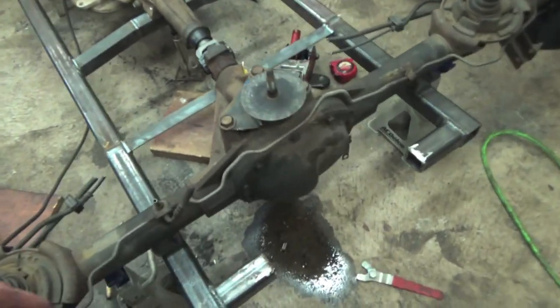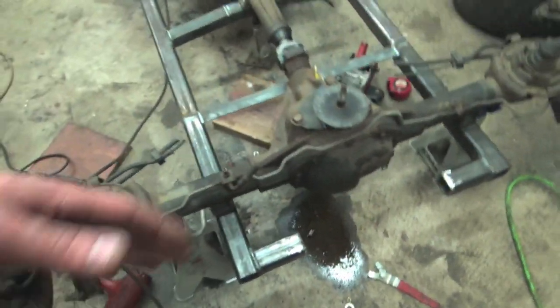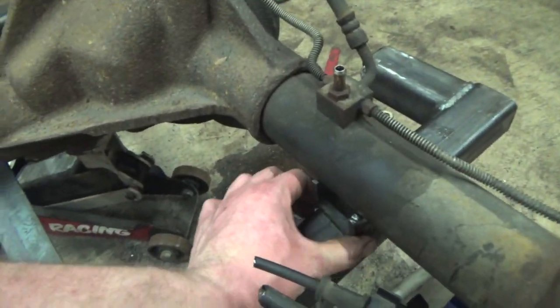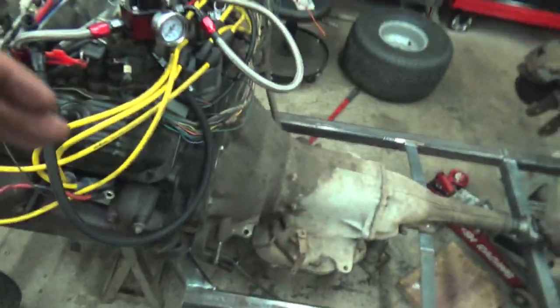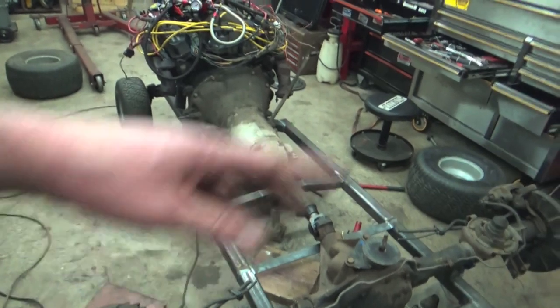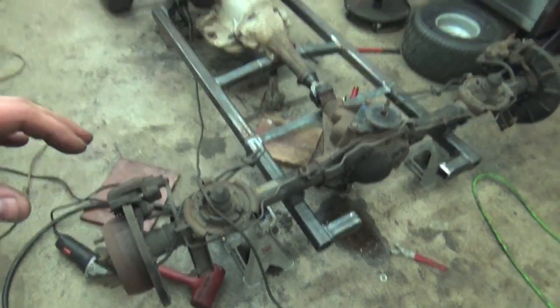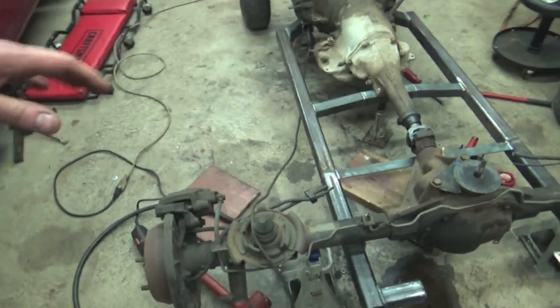We've been welding, chopping, and cutting metal getting this frame finalized and welded up together — not totally finalized because we still have to pull it apart and finish welding underneath it, but it's pretty much almost all the way done. I did run out of metal — I wanted to attach a trailer hitch right here so we can move trailers around with this thing. We do have a couple of cross braces added in, the extension pieces put on, and the leaf spring shackles in place. This thing's ready to be pulled apart and fully welded together. After we finish welding the back piece, we need to find a trailer hitch to finish it off. The rear end is ready to come off the frame and get shortened, but we're going to have to save that for the next video.